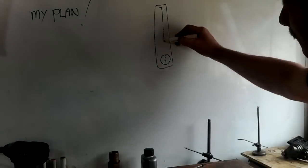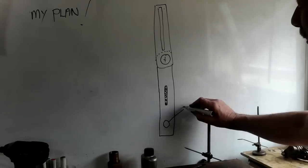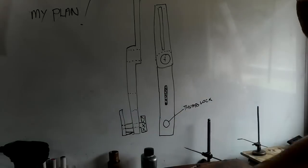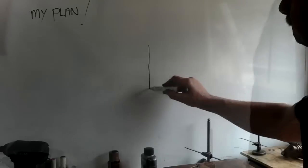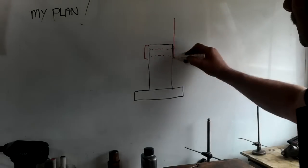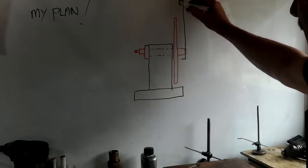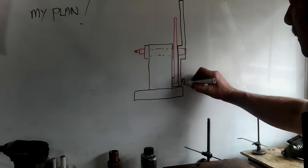The arm, a device that manipulates the gear blank under the cutter, is clamped to the indexing plate via a clasp or a clamp that works a bit like a disc caliper on a car's braking system. It should easily allow the index plate to be freed, indexed and then reclamped. What I'm drawing on the whiteboard is a side view of the index plate and the arm mechanism. These rough sketches are my way of working things out, and they've always proven to be most successful.